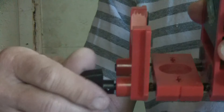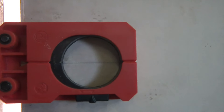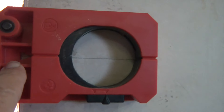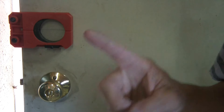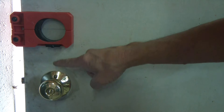Little side note: this is self-centering. You need one knob and both sides open and close equally — it keeps it centered. So I'm going to slide that on there. Right there it's centered. This is in line — look at that right there. If you can look in the hole here, you'll see it. It gives you a better level view that this is centered. One more check — make sure for the third or fourth time, because again you do not want to drill this and not have it in line with two different setback settings. Check again — it is in line. We're good to go. Now we can drill.